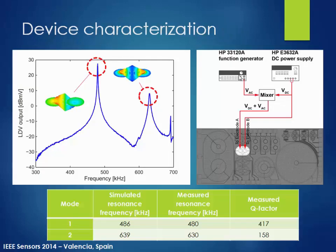After vacuum sealing, we did the initial device characterization by applying a DC bias to both sides of the diaphragm but applying an AC signal to only one side. We then measured the motion of the diaphragm using a Laser Doppler Vibrometer (LDV). The first peak in the response is the rocking mode and the second is what we call the flapping mode. These results closely matched our FEM simulations, which also incorporated the vacuum sealing effect.